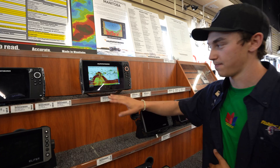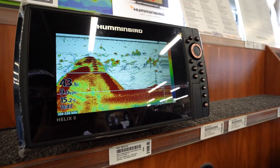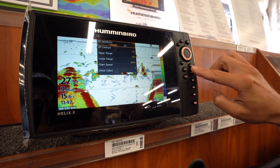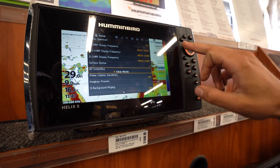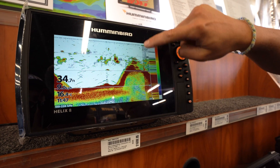You have two options and it kind of depends on what you're reading at the moment. For example, if we look at this screen here, we can see a lot of arcs but a lot of surface clutter happening in between. So we can either crank our sensitivity down — we are in clear mode right now — or you hit menu once, menu twice, go to your sonar tab, and go down to 2D SwitchFire. Now we're going to put it into max mode, and you can instantly tell the difference right here.